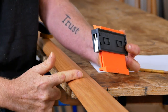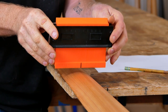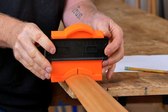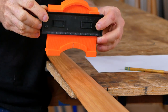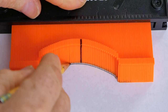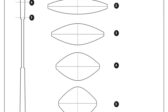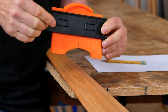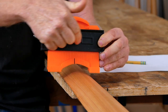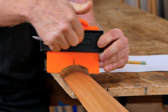To use the profile gauge, at any time during the final shaping process you can come to one of the marked blade stations or anywhere else along the blade. Put your fingers on the outside of the plastic fingers so they don't spread apart, and then gently push down over the shape of the blade. Set the lock so it doesn't move, then either eyeball the shape to see how it compares to what you're hoping to achieve, or trace it onto paper and compare to the shapes in the paddle plans. If you're working from our plans keep in mind it won't be an exact match since your blade might be a little bit wider or narrower — you're just looking for a shaping comparison.